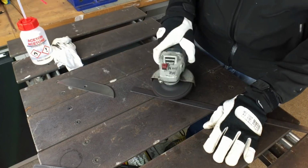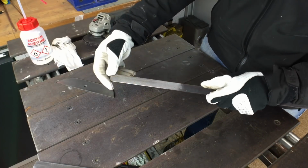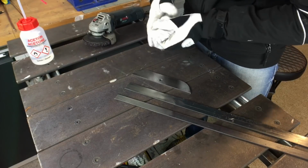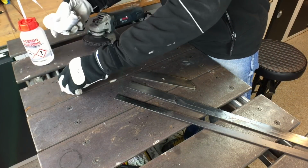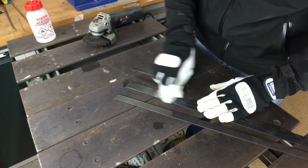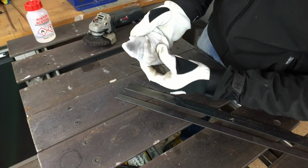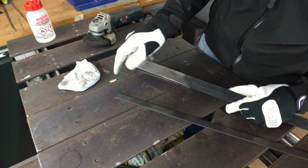Similarly, this is more of a traditional mill scale that you see, but this comes off even easier, and like I say, this disc just does the business. So really nice and shiny material, or that's how you would think of it, but I'm just going to show, for demonstration, taking a white bit of cloth here. Obviously you can see that it's nice and shiny, but taking some acetone, just dampening that down, and then rubbing over the top of the material, you'll see from here that, oh my goodness, look at that. That is absolutely minging, dirty as hell, and that's going in your weld. So the cleaner you can make stuff, the better your weld's going to be.